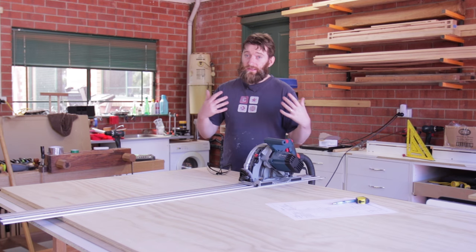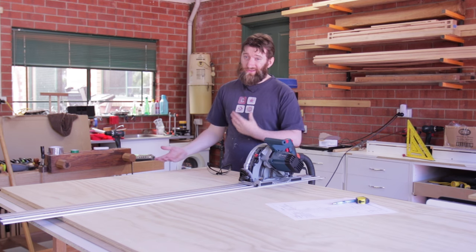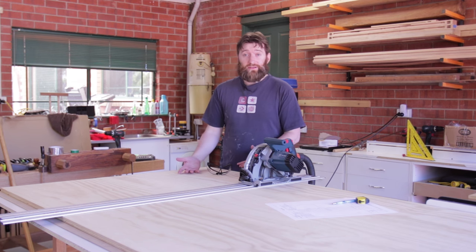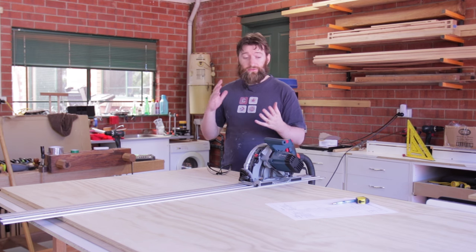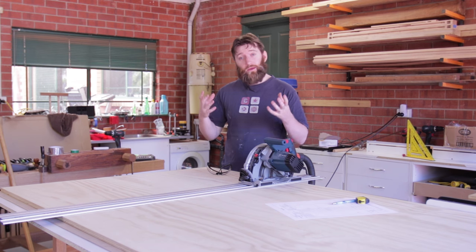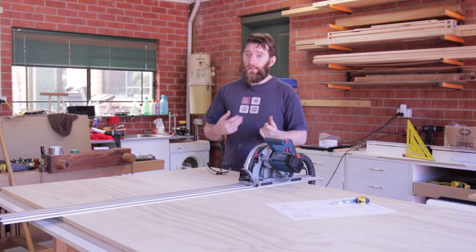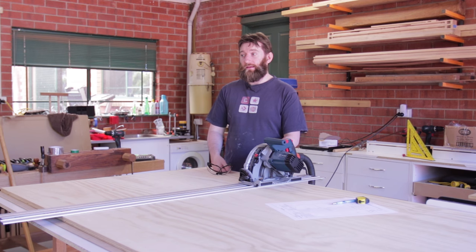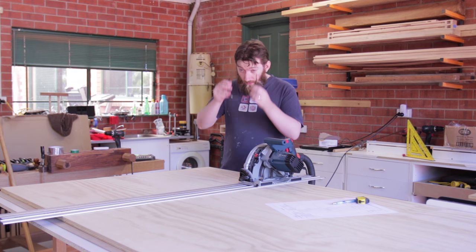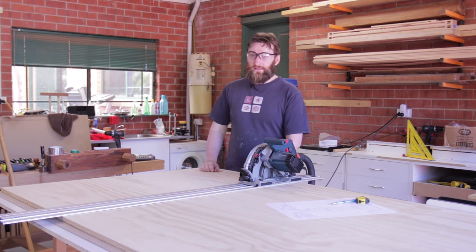For the joinery it's just going to be screwed, nailed, and glued together. One tool I don't have for this project that would actually be ideal is a pocket hole jig, particularly for the side pieces — they're going to be difficult to clamp because of the angles. A pocket hole jig takes care of that: you still glue it, but the screws hold it in place and you don't need clamps. And don't forget, there's nothing more important than safety glasses.